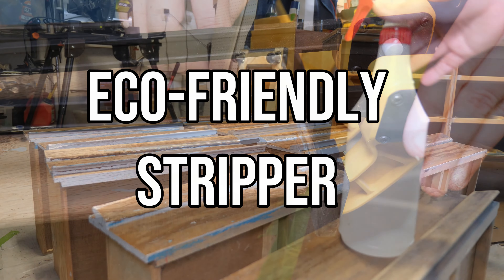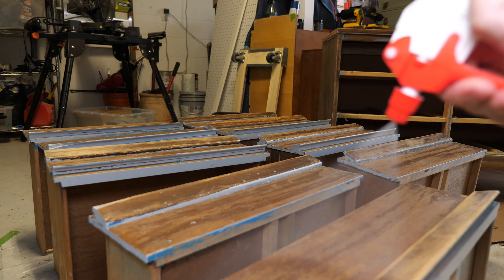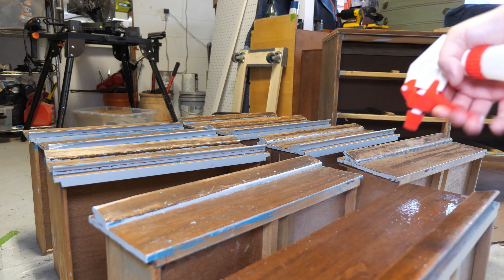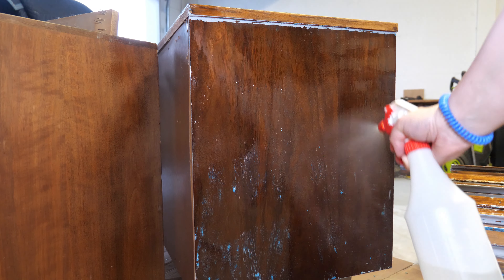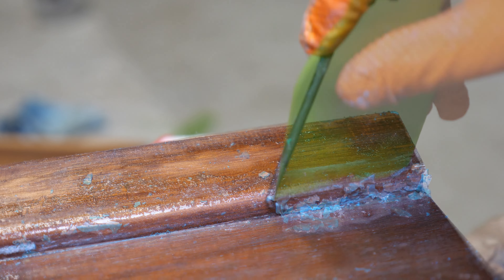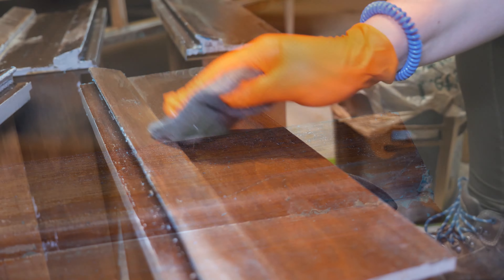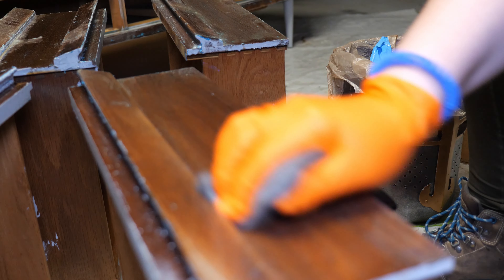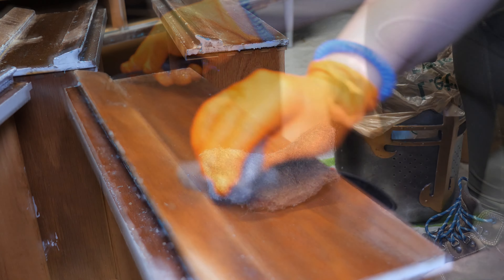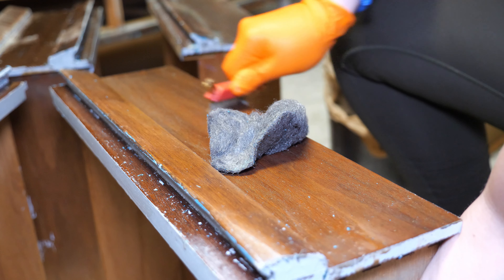A substantial amount of paint was still on the curved drawer handles and embedded in the wood grain. I opted to use Stripwell's QCS stripper, which is an eco-friendly stripper, to remove the last bits of paint. If the steel wool did not dislodge the paint from the wood, I first tried a nylon brush, and in certain areas I did switch to a soft brass brush. I'm certain this is going to be a point of contention, and some of you are going to cringe, but this specific brush is made for stripping soft surfaces. I wouldn't use this on soft wood, but the veneer faces on the drawers is walnut. It certainly made me a bit nervous to use, but the alternative is to spend one eternity hand-picking paint from the drawers. Honestly, it was quite effective and probably saved me a lot of time.